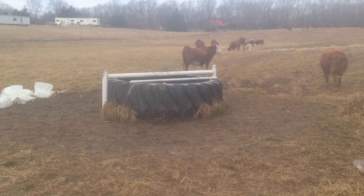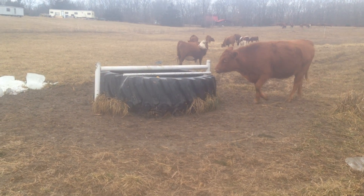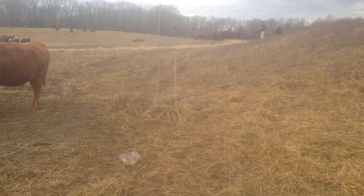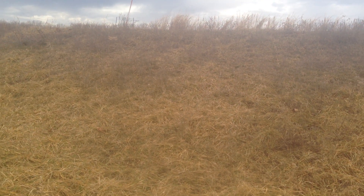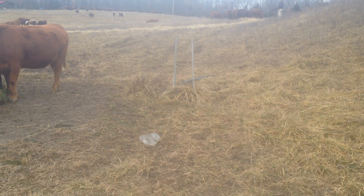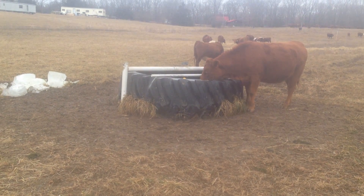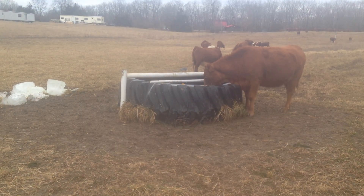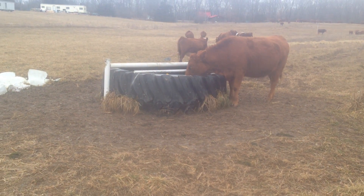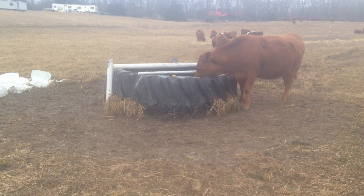Good morning, Greg Judy at Green Pastures Farm. We're here in wintertime and I'm going to show you our tire tanks that we use for our winter water systems. This is an earth-moving tire mounted on a pond — you can see the dam up here. That pipe goes out from the bottom of this dam when this pond was built. Right there where those two stakes are, there's a shut-off valve, so I can shut this tank off when I'm not using it. It's got an inch-and-a-half brass valve with an inch-and-a-half flow of water continuously feeding it. That cow drinking there is taking maybe five gallons, and on a hot day this thing holds about 800 gallons — it's a big tire.